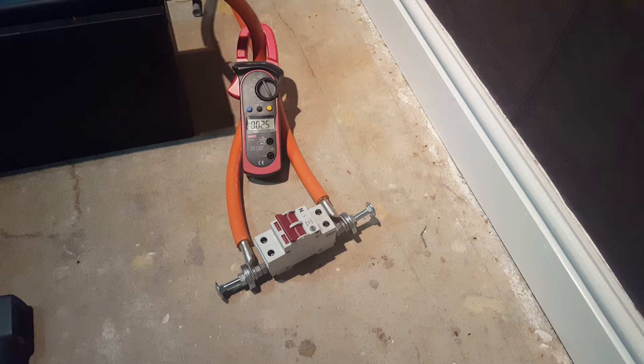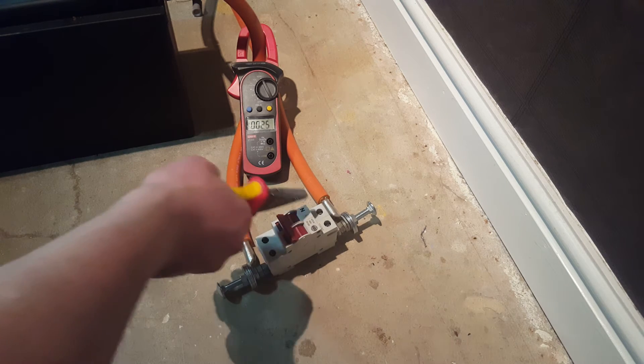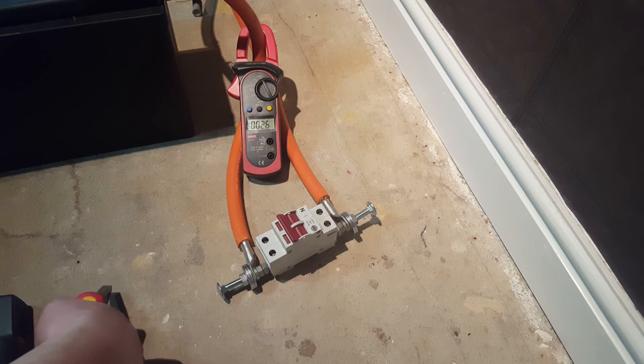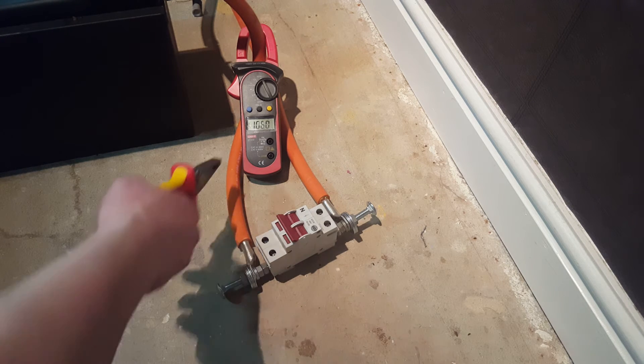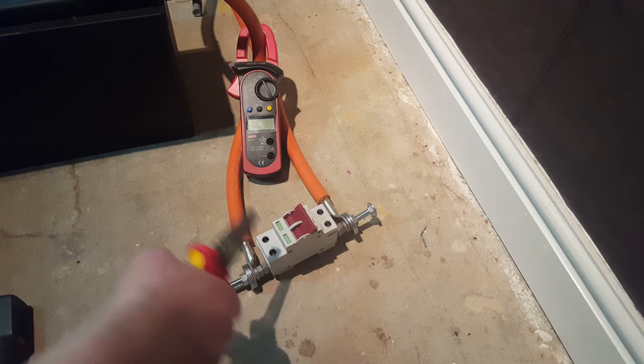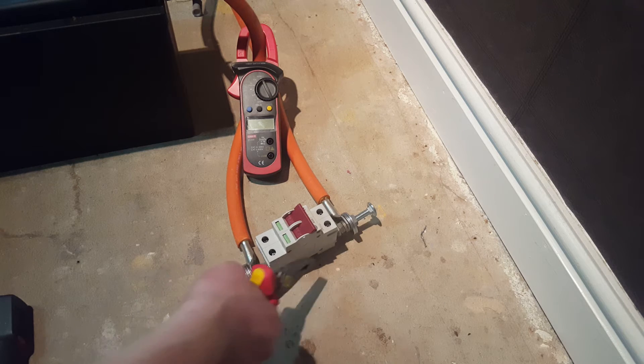I'm not going to give up, but I'm going to limit it — I'll put a thousand watts through it, so it'll come to just over a hundred amps, which is what this thing is rated at anyway. Putting 200-odd amps through it hasn't done any good, but luckily we've got a clean terminal that's never been touched, so we'll be able to see the difference between the used side and the clean side. It's a thousand watts — 106 amps — let's isolate. Hopefully from that we'll get a little bit of spark gap damage inside to see the difference.